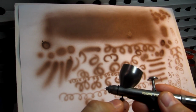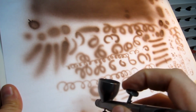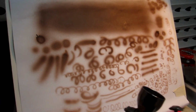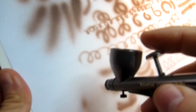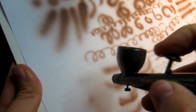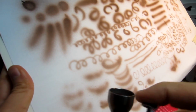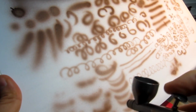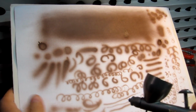So it seems there's a very fine, let's turn a quarter turn. Can you hear that? That's when you're getting spattering. And usually, if everything was normal, you can turn it just maybe an eighth of a turn. It's too much. There seems to be a very fine line of where this is sort of set.